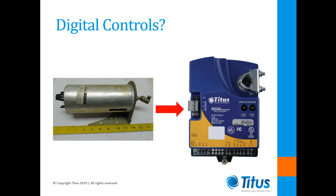Also, the seals on the damper blades have likely deteriorated and may be impossible to replace. This could be a major problem, especially on dual duct units where tight damper close-off is critically important.